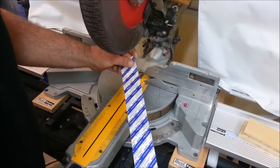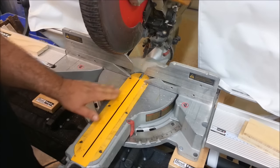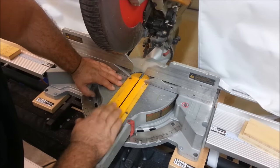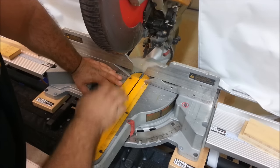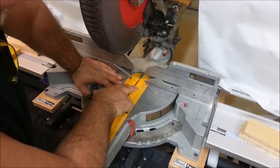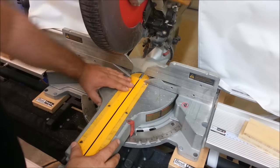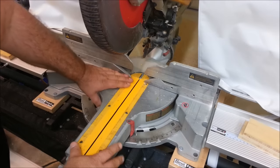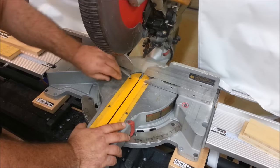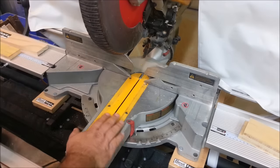When you get it, it comes with a speed tape on the back — you just pull the tape off, feed it in there, and plop it down. I've gone a step further: I've taken off my original guard and actually sanded down the base a little bit so when I attach it, it's almost level with the bed. This is level with the bed here so I don't end up with a variance. If you've got a piece that's 12 inches or longer, that little lift is not going to make enough of a difference to matter. But if you're doing really short pieces, it can pull that edge up a little bit and bring your cut off.